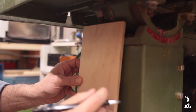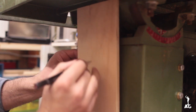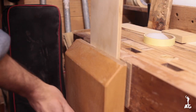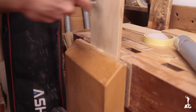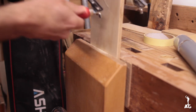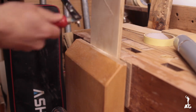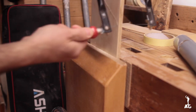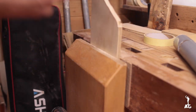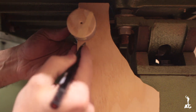Watching Rob Cosman as he explained the dust collection on his bandsaws, I was inspired and I tried to replicate that as best as I remembered it. Basically, he uses a PVC pipe where the saw blade actually goes through it. So that creates a suction effect, which helps a lot with dust collection. As you'll see later, at least on top of the table, there's very little dust.